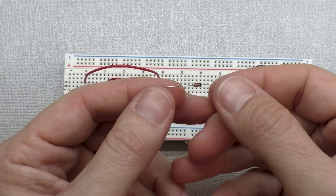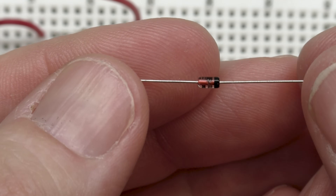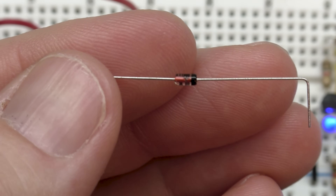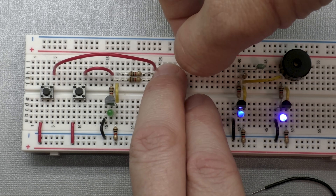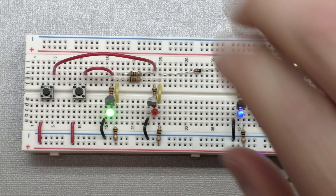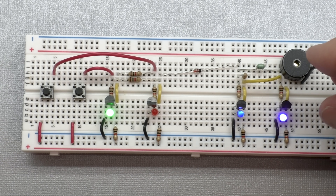The next piece we're going to add is called a diode. This diode allows electricity to move in one direction but not the other. The reason we want to use a diode is we want to feed power from the SR latch over to the oscillator without it feeding back to the SR latch. These two circuits connect together from the output of the SR latch to the input of the first inverter on the oscillator. We're going to connect this back up so we get our sound, and now we can turn our sound on and off.